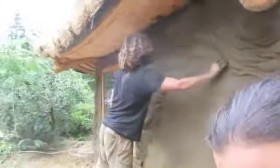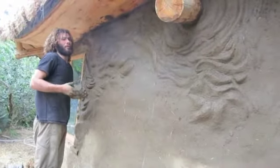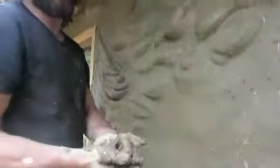What's the mix? Tell us about the mix. What's it feel like? It's wet — it's wetter than you would typically be working with if you're doing structural cob. If you were doing structural cob with this, it'd be slumping real quick on you. You can just see how this one's even actually a little bit on the drier side of what I've been using, but it still smears. It's super smeary, and there's a pretty good amount of straw to hold things together.